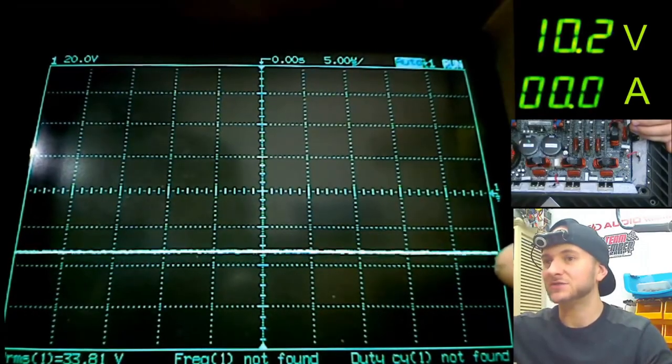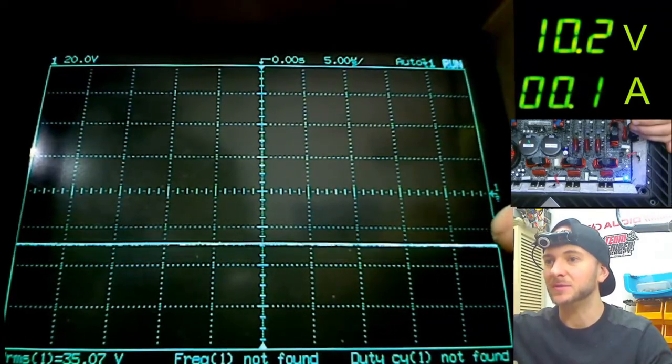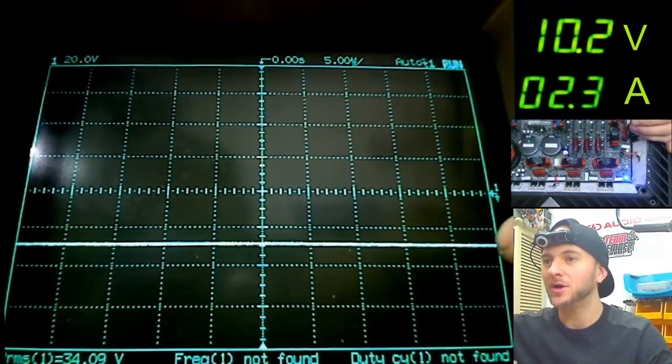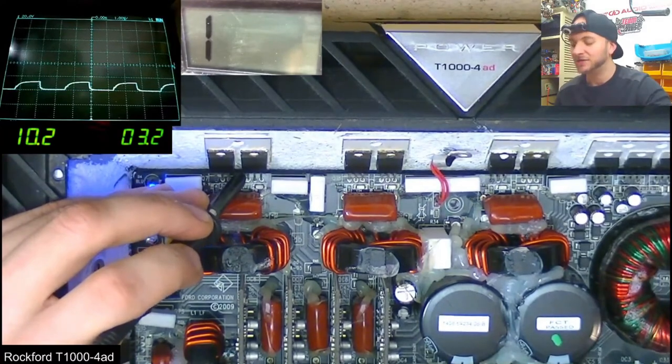This was as a result of the drive circuit for this channel telling the low side FET to turn on fully, as seen by a bump on the low side gate on the scope screen. Whereas here we should have a nice drive wave instead — these little pulses telling the MOSFET to turn on and off.